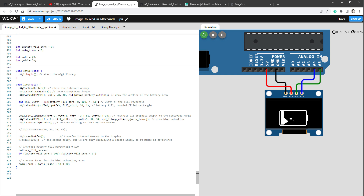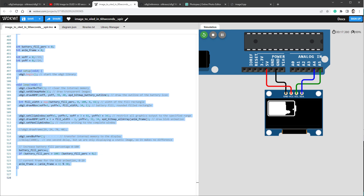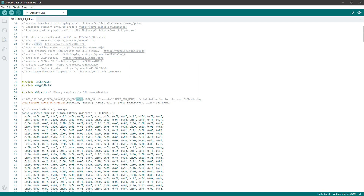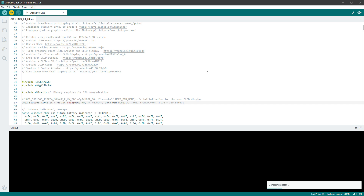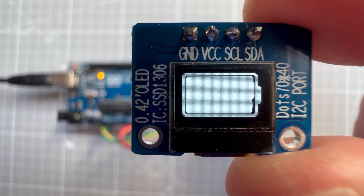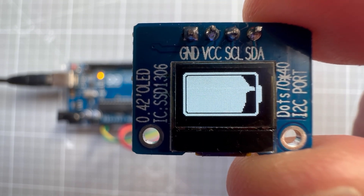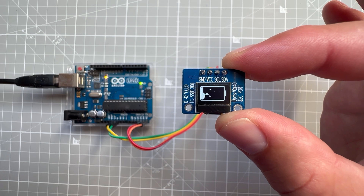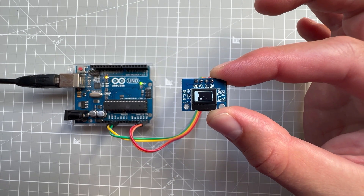To make the sketch work on both the big and small display, I separate the offsets into xOffset and yOffset variables. Setting those to zero places the battery at the top-left corner. I copy the correct constructor line from the U8G2 documentation — SSD1306 chip, 72 by 40 pixel resolution, full screen buffer, hardware I2C — paste it into the Arduino sketch, and upload one more time. With less memory to manage the animation plays much faster. This tiny display is bright, has a decent resolution, and I'll definitely use it in future projects.